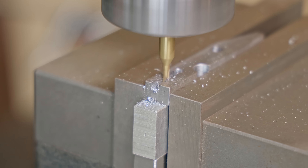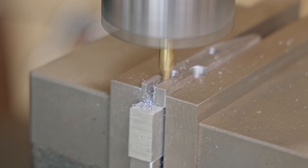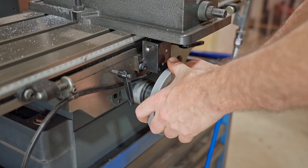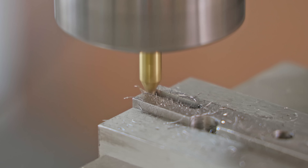I'm taking very shallow cuts so I don't snap the 3mm end mill, as I don't have another one to hand. The slot needs to be 3.5 millimetres, so I'll move the table over by a quarter of a millimetre. I'll mill one side of the slot and then do the same on the other side.